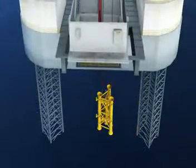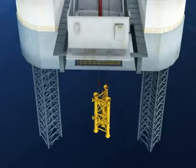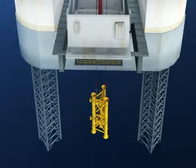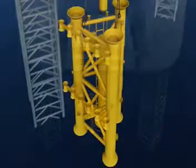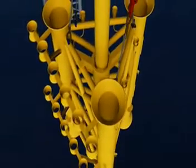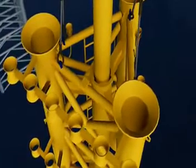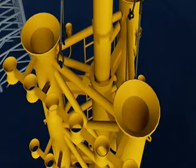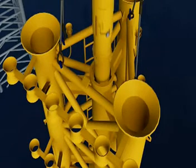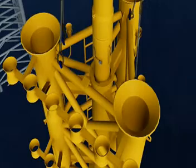When the center slot has been drilled to depth, the bottom hole assembly is withdrawn and the subsea structure positioned under the rotary table. The conductor is run through the center slot until it reaches the running joint, its position on the string determined by the pipe tallies. Rotating and lowering the string engages the running joint with the landing rings in the center slot, at which point the weight of the structure is taken on the string.